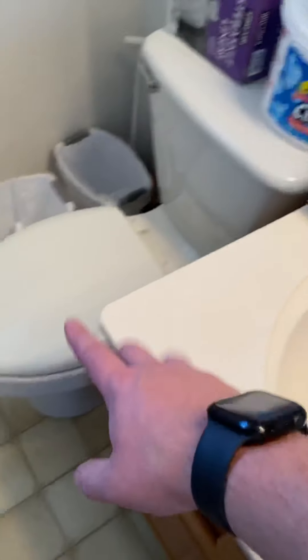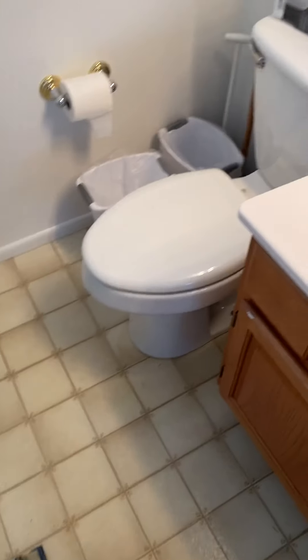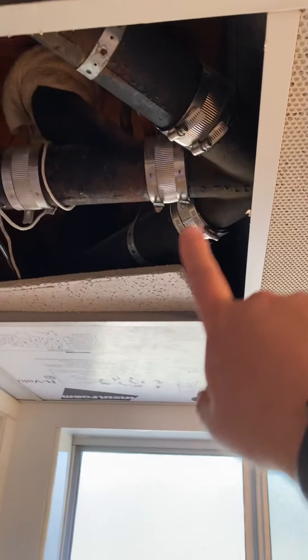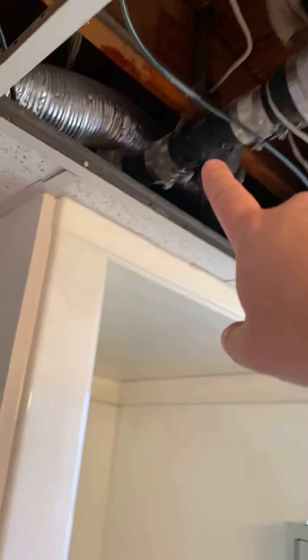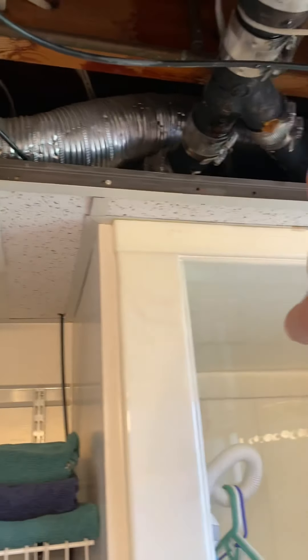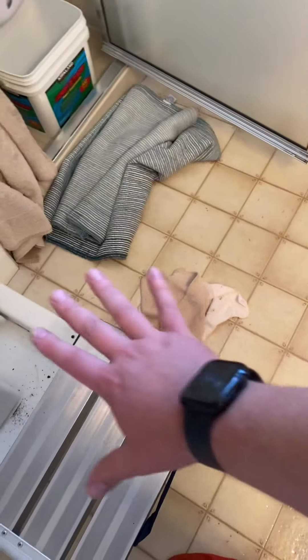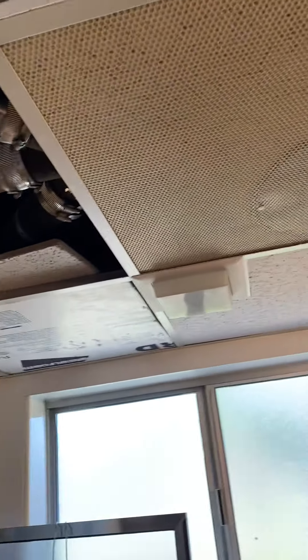Over here behind the wall is the toilet. We'll redo the stacks coming up — there are removable tiles. You can see all this exposed: toilet, tub on this side, shower over here, another toilet in the master, and then it runs over and down picking up the sink. New toilet, new quarter turn here. We're not removing the shower — just pick up where you can on that. This is pretty much where all the work is happening: underground here, above ground overhead, and the utility room down there.